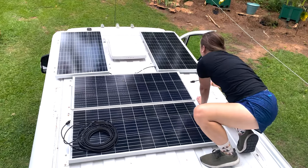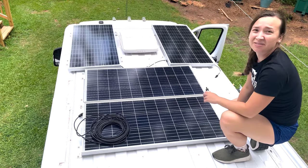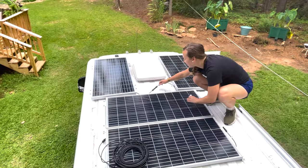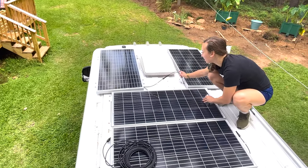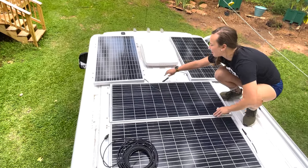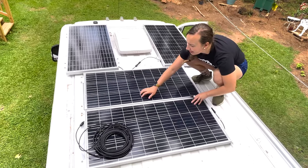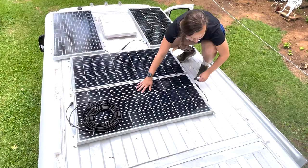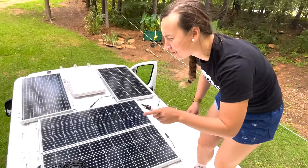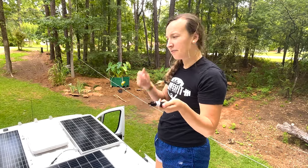This is our one solar panel that has the free negative. We put together the negative terminal of this side and the positive terminal of that side. So the negative terminal here goes to the positive terminal here, the negative terminal here goes to the positive terminal here, and then we have a free negative terminal. Always be careful on your roof. Now we have this inline fuse — it's a 10 amp, 1000 volt inline fuse.